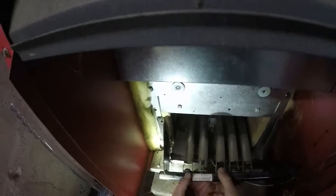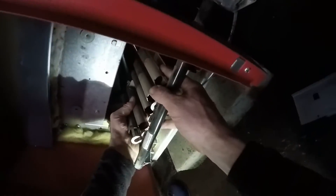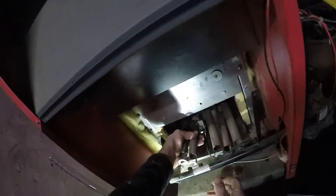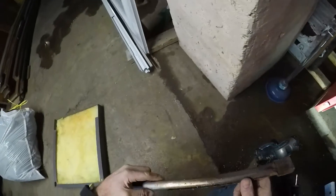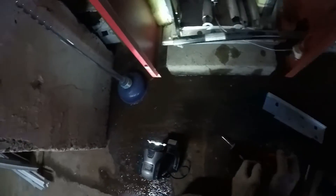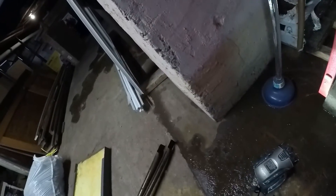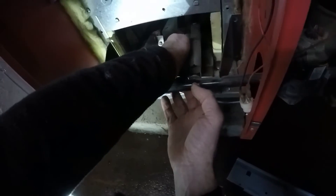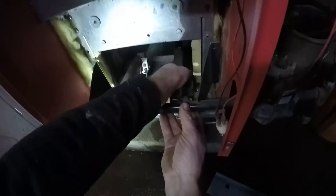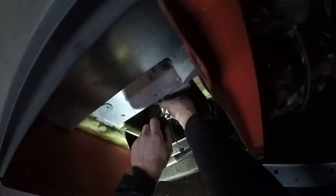I think what we've got to do is pull this out. The water on the floor here is because when we get a big snow melt or a hard rain, the ground gets saturated. In this particular case, we had a foot and a half of snow on the ground, then we had a thaw, then we had rain. That is why the floor is wet — it comes through the foundation.